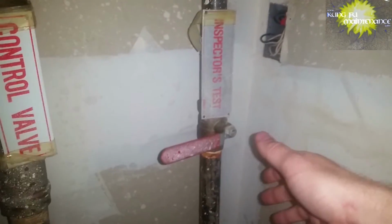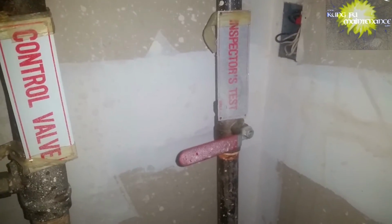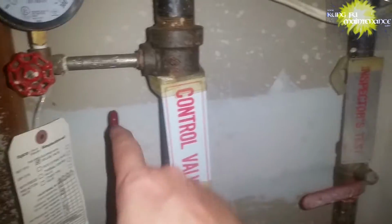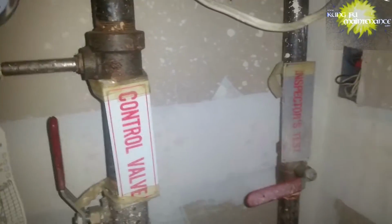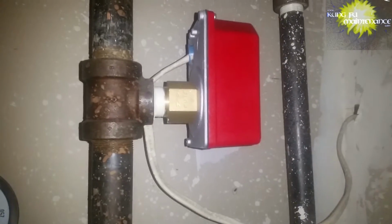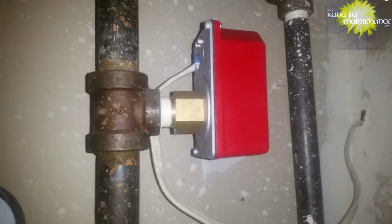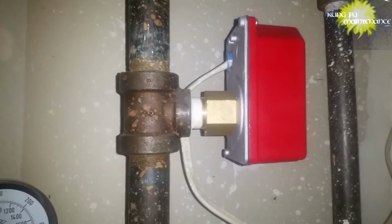Thanks for watching. And there's definitely a few things that sometimes go wrong here. Sometimes the needle sticks on a gauge, and releasing the pressure sometimes can release that. Sometimes the needle gets stuck in a certain spot. 50 pounds on the low side is about normal, and 200 pounds on the high side. You don't want to see it go over 200 pounds. But that being said, sometimes a needle gets stuck in a particular position, and you'll get a more accurate test once you flush the system.